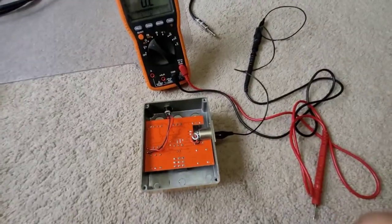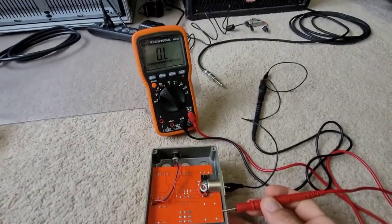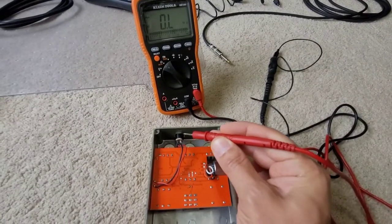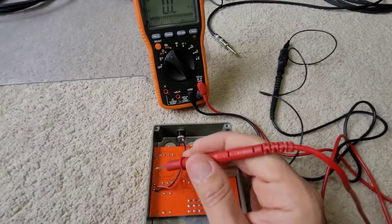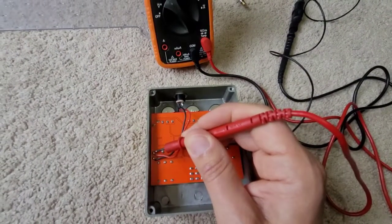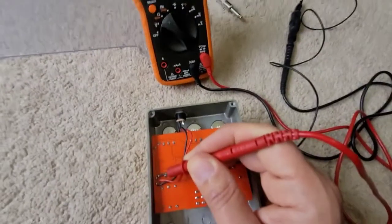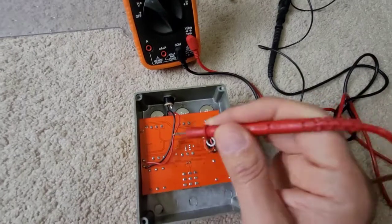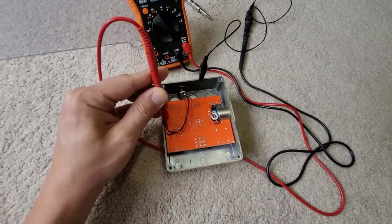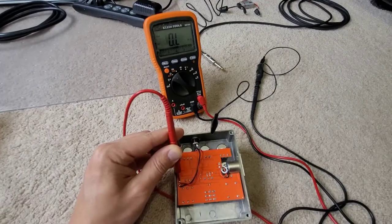One of the features I wanted to check is what is connected to pin 1. Pin 1 is supposed to be the shield ground, and I wanted to see if it's connected to the frame of the pedal — it is not; it is floating. Next, I checked how the negative portion of the incoming DC connects to pin 1, because that could indicate potential for noise. Probing the red wire — and as many people know, effects pedals are barrel positive and tip negative — I'm seeing just under 11 kilohms. So there is a high DC resistance from the grounds. I'm also happy to report that the frame case ground to the negative signal ground of the board is floating as well, which means they did that correctly.